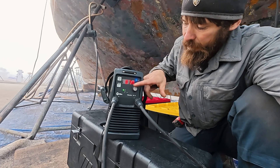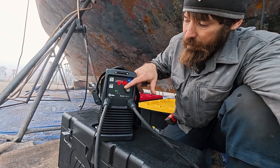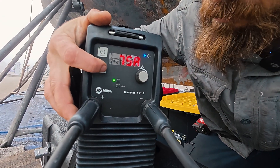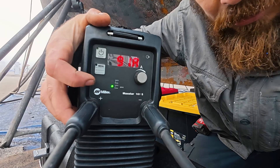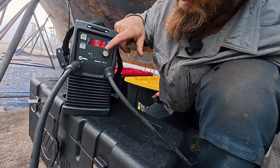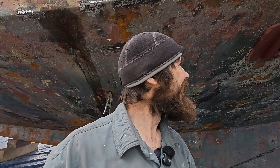It shows your normal OCV and here's your amperage knob — just this dial. I was doing 1/8-inch rod last night at 87 amps, but you just dial it up and down, that's it. It's got a mode for 6010 — just push the button and you're in 6010 mode, then back to 6011 or 7018 or whatever you've got. It has a hot start feature, so I've been burning this 3/32 rod all the way down at 65 amps, and it puts out a bunch more amperage at the very beginning for a hotter start. It also has a stuck rod feature that turns off the current when it senses a stuck rod so you're not melting your rod stuck in one spot.